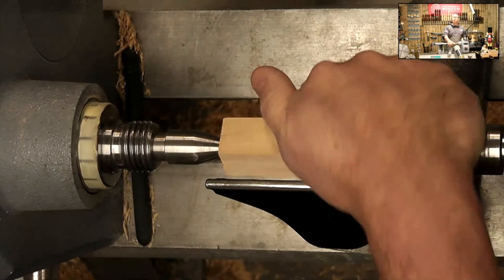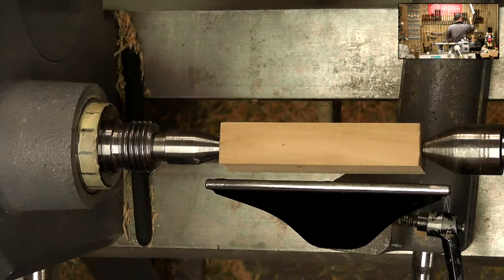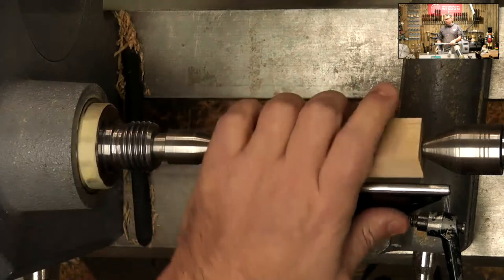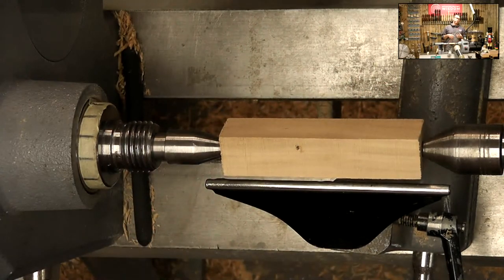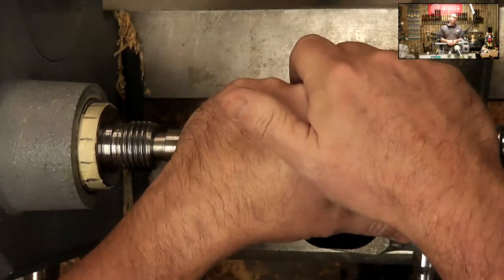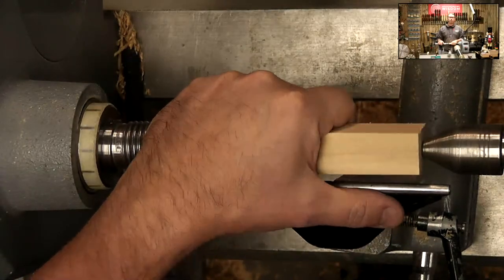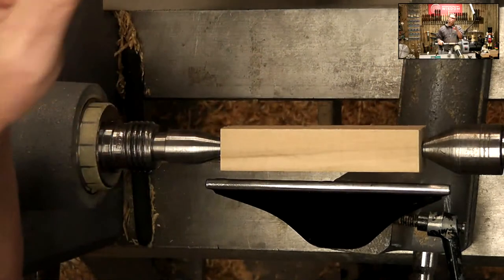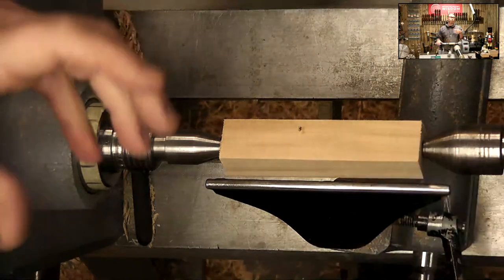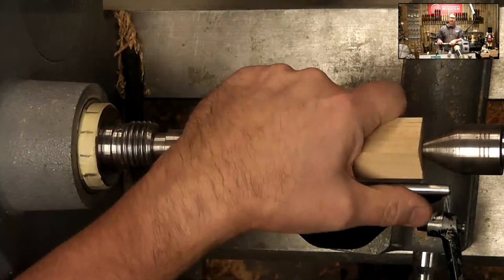And before I do that, we're going to answer another question. Yes, Ben. So Grander P would like to know, he has some fallen pine in his garden. How long to dry the logs before turning, please? Oh, so the best thing you can do, if you're going to convert from fallen trees, is you need to split them back first, even rough turn them. Pine, I wouldn't, in terms of bowls and things like that, yeah, you can practice on it. And certainly, I would put it into billets for squares. So for doing things like this, for 2x2s, 3x3s, lamp bases, those sorts of things, it's not going to act particularly well.